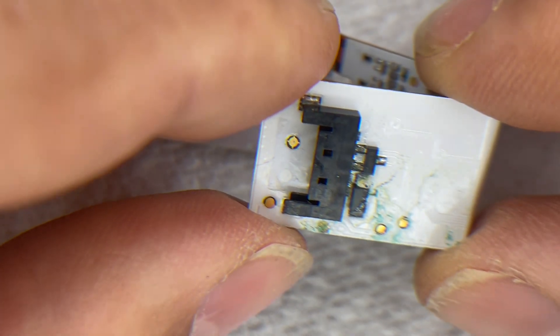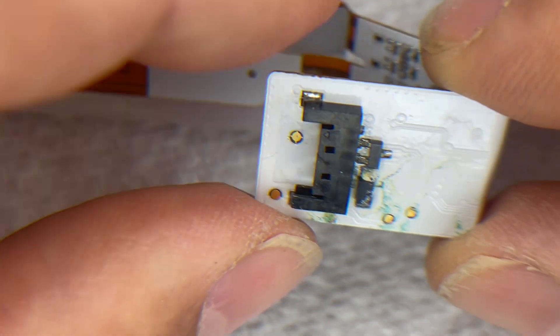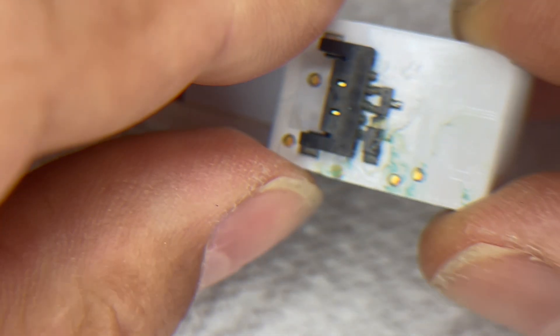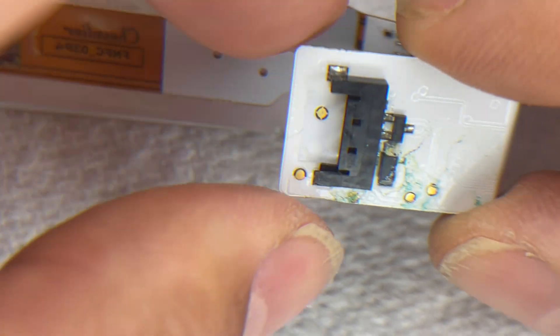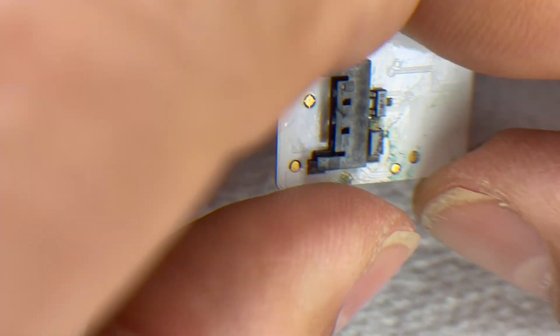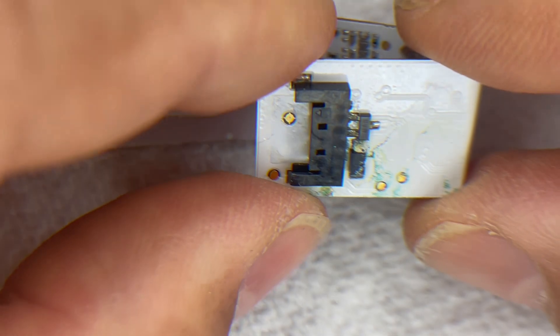It's really either one or the other — you either spray it with oil and then you can't really varnish it afterwards unless you degrease it. But what I'm going to hope is the oil not only dispels and ejects any remaining water after I put the ethanol on it, but remains on there to continue repelling any water that might get in. And then I'm going to try and waterproof the enclosure so the water doesn't get in again.